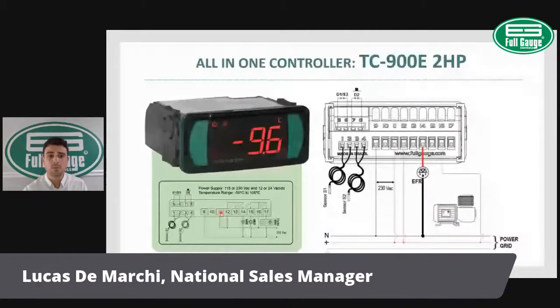Now, I would like you to take a look at terminal 12 and terminal 16. These are the commons. That means that once you feed power to those terminals, you're actually energizing the relay circuit. And the nice thing about having an independent common for the relay circuit is that you can power the controller in 110 and the compressor through it, or the controller in 230 and run a 12 volt solenoid through the output.